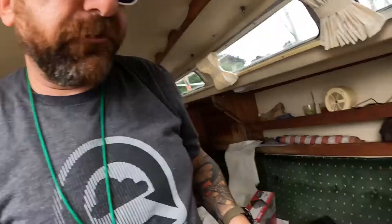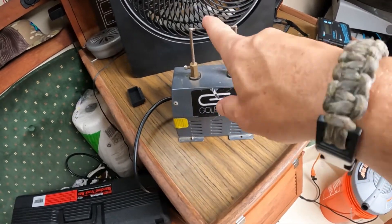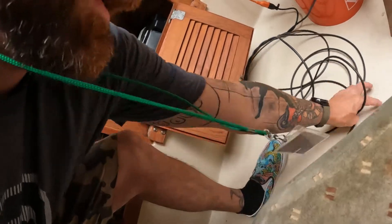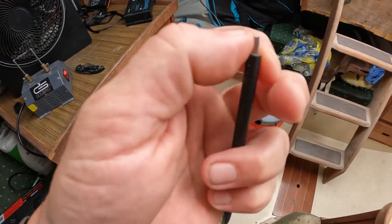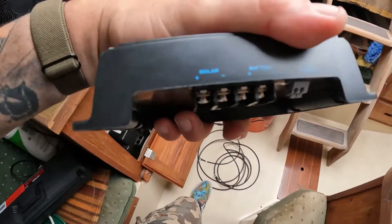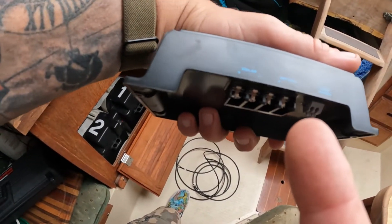So that's my hot knife — I actually use this for my other company; we sell pull-up cords which we use to back parachutes. So I have a pretty decent one. But back to solar. So I have these wires — they've been on the boat for a bit. The ends come pre-cut, but I've been crimping and uncrimping them, so they're a little messy. If you look at the back of your controller, you're going to see it says battery, which is right there, and then solar. So the battery terminal is positive and negative. Very simple — just go right to there.